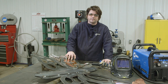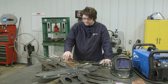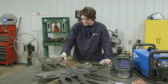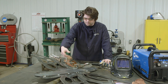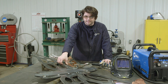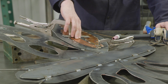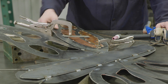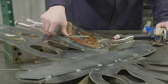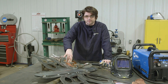Now I'm tacking the copper to the steel and I'll run a few small beads as well. It takes a while because copper is fun to braze, especially something this thin — it always wants to lift up from the material. We didn't do a lot of overlap so there's not much space for the heat to go, so I'm moving around, tacking it, hammering it down, and clamping it as I go. This clamp has another piece of metal behind it to push the copper into the steel. I'll keep tacking and then run a few beads to hold it in place.